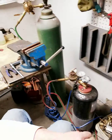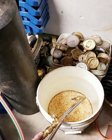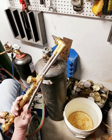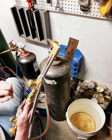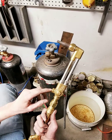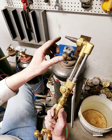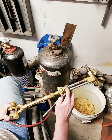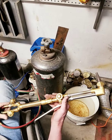After you've shut the valves off, test the torch in water to make sure there are no leaks. You can see there is a leak here — it's probably coming from here or there. You can tighten this valve up a quarter of a turn and smack it with a hammer to be sure it's sealing. Then take the other valve apart and look. It's probably not this valve since it's a very small leak. Put your finger over the tip, dunk the whole thing underwater, and check for leaks at the connections and all external joints.